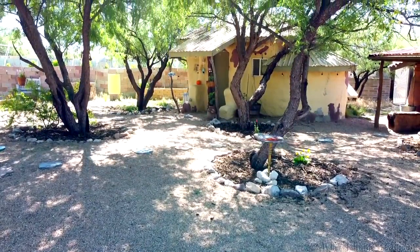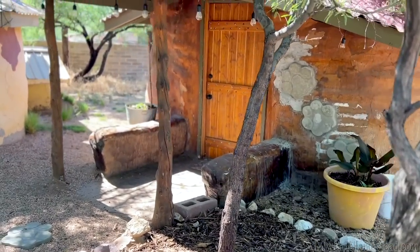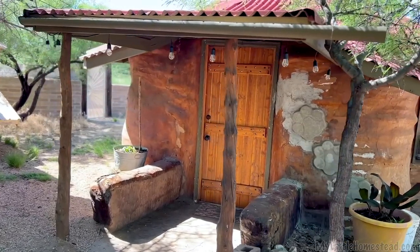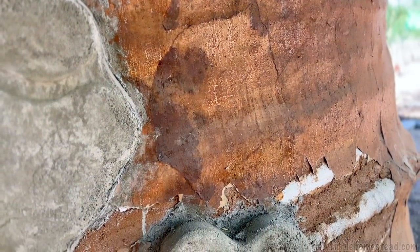Our family has tried many exteriors over the years. We started with my earthbag bedroom using cob, a mixture of clay and straw sealed with linseed and paint. We used a paper bag finish on Garen's earthbag bedroom, which was just a temporary experiment. It's held up surprisingly well. We're only now moving to replace it.